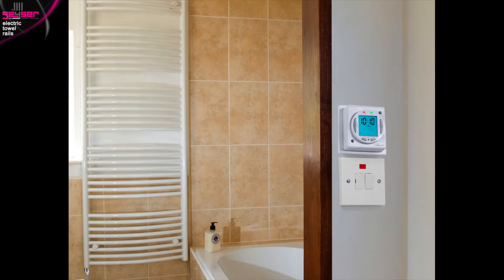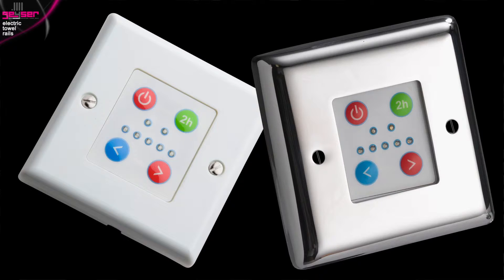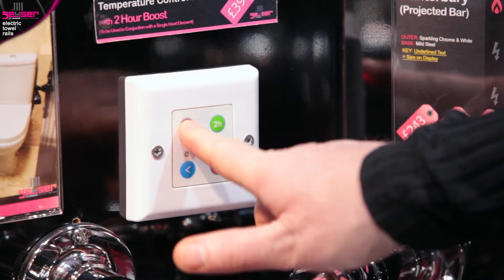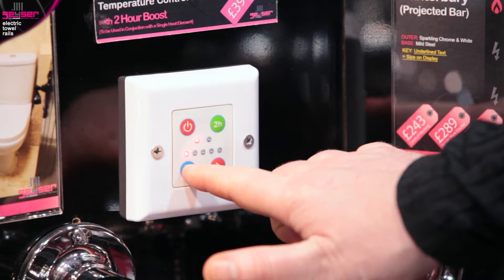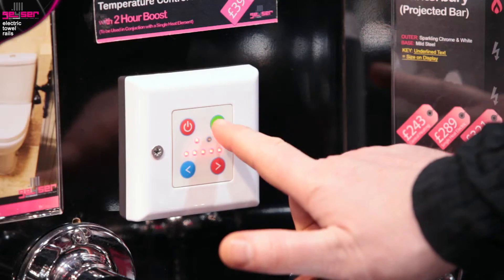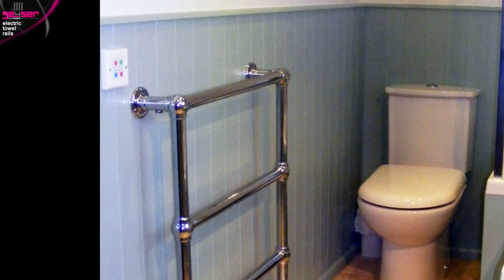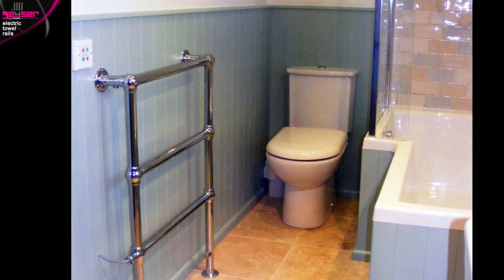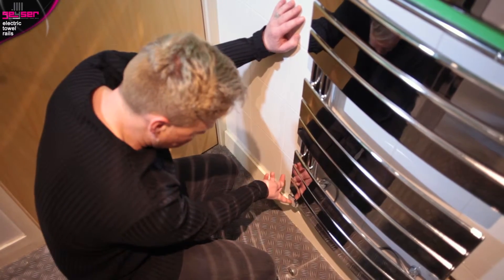Neither timer is IP rated for use in a bathroom, so must be fitted outside. Note: if switched off and then on again by the timer, the variable heat element will remember its temperature settings. Secondly, we offer a temperature control plate in white or chrome. This device gives you the functionality of controlling the temperature of a single heat element. This has often been retrofitted by customers who found the room or surface temperature of single heat too hot. It also features the two-hour drying function button. One advantage of a single heat element with a temperature control plate over a variable heat element is that you can have the controls located at eye level, preventing the need to bend down to access the controls on the variable heat element head.